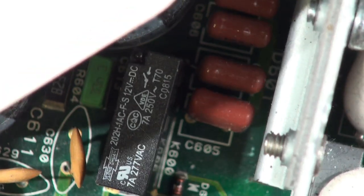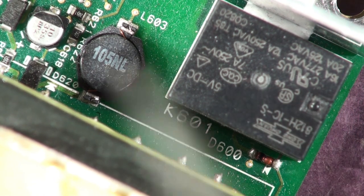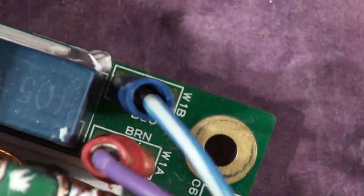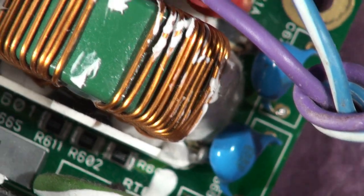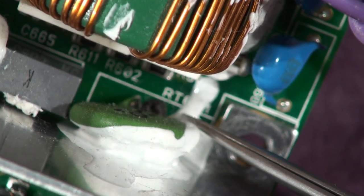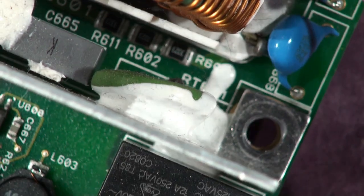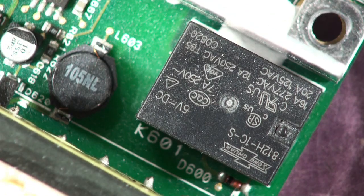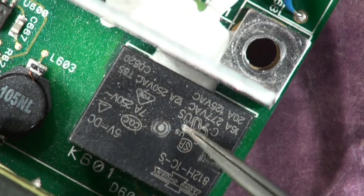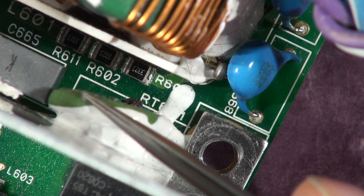If you're running on 200 volts plus, you're fine. This whole relay over here is driven by the 5 volt side of the secondary, and it shorts out this PTC — a positive temperature coefficient thermistor — which is glued to the back of there. When you put the power on, that starts heating up. But just in time, when the DC power comes on, the 5 or 15 volt rail switches this relay, which then shorts that thermistor out, preventing it getting any hotter.